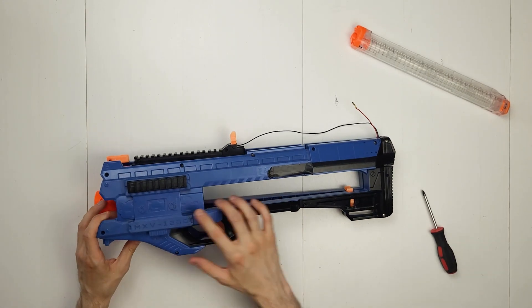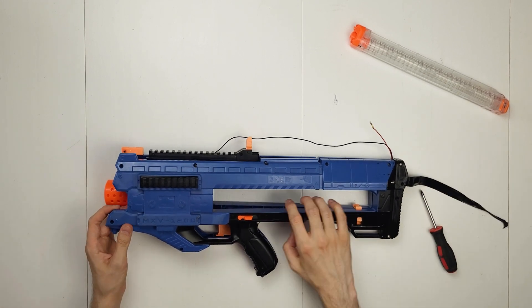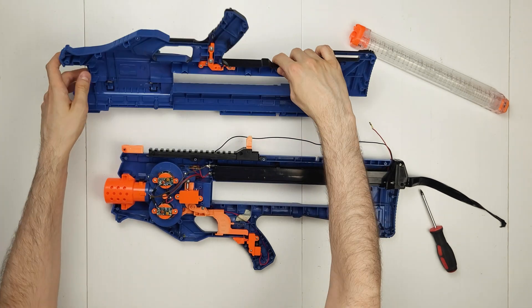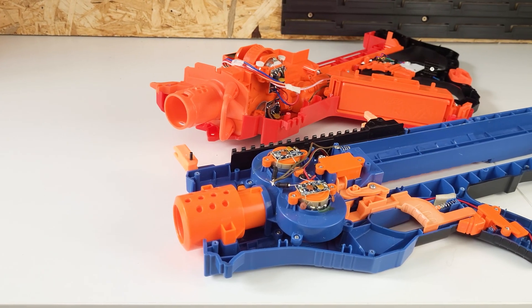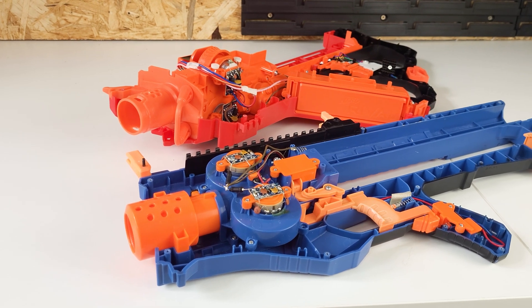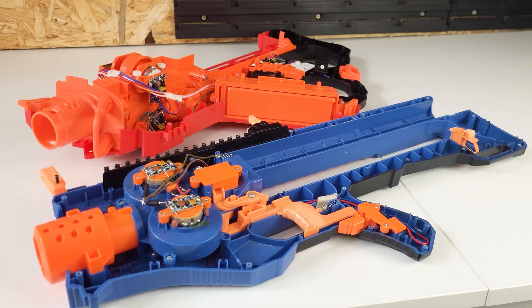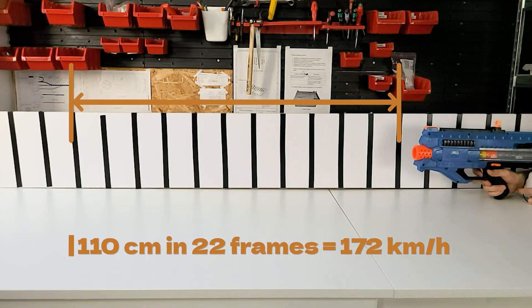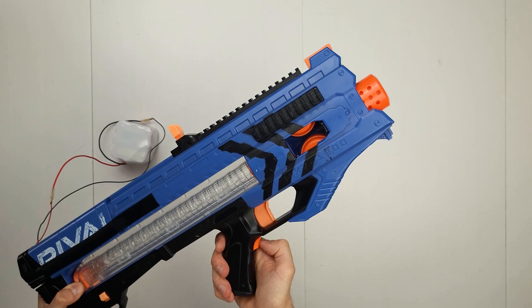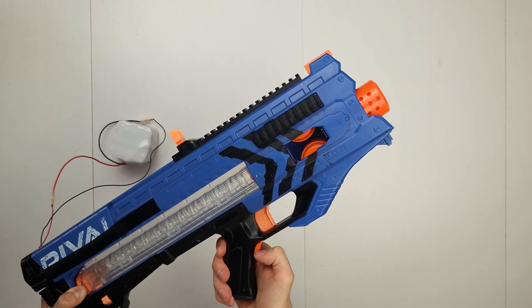The auction said it might not work, so I risked my $20 and bought it anyway. It came with four other guns which I just threw away. The shooty bit is basically the same between the two, but I wasn't scared to break this cheaper one. By just changing the battery to a 24V one, I was able to fling the balls at around 172 km/h — a very nice upgrade — but it's incredibly straining on the motor and it sounds like it's going to give up any second.